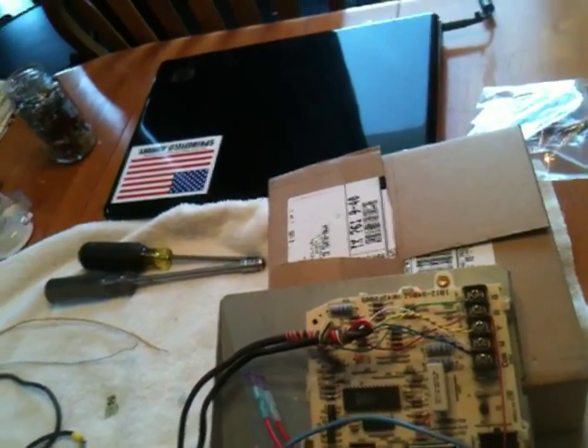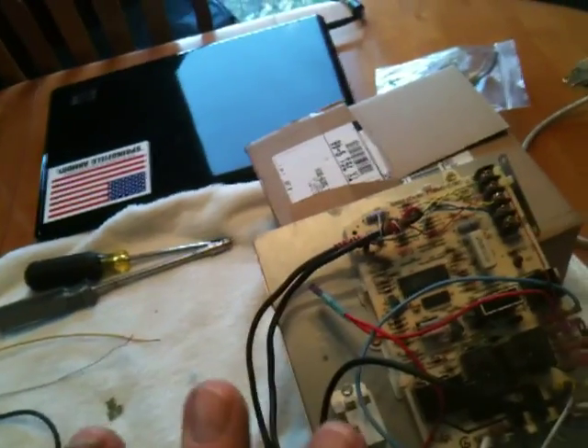It's a little bit different because we need to put something in the circuit since something's wrong on the board. Let me admonish you one more time: technicians out there, it's okay to bypass a board temporarily to give them air conditioning. Never, ever bypass a board to give them heat. You don't know what's wrong with the board — it might not just be a relay. You could have burned traces, other damage. Some safety on that board could be shot. Turn the gas off and leave it off until you come back with a new board. It's okay on AC because the only thing the board's doing is passing control to one relay from the thermostat — it closes and opens one relay, and that's it in cooling mode.